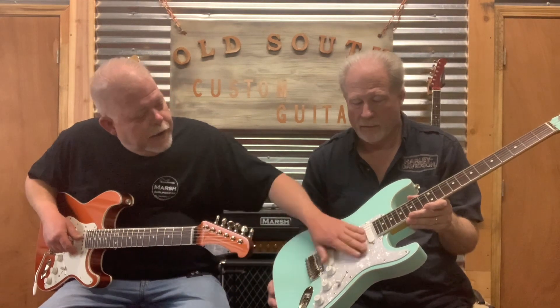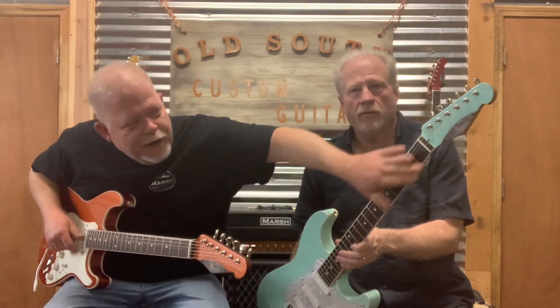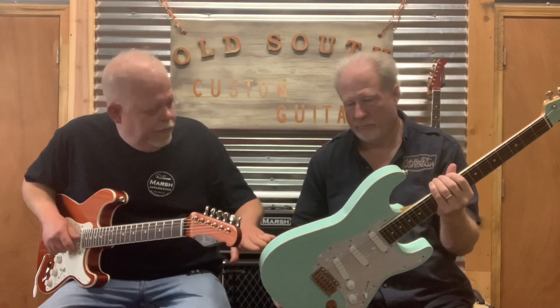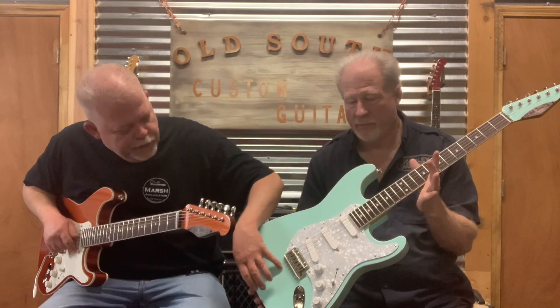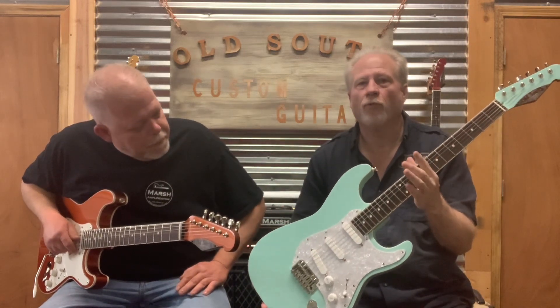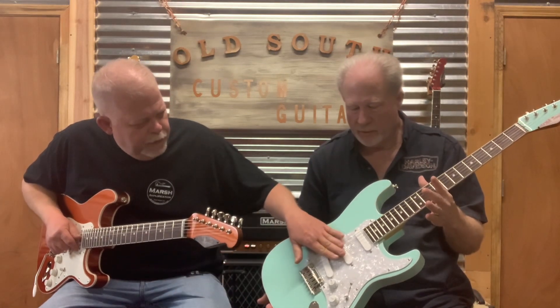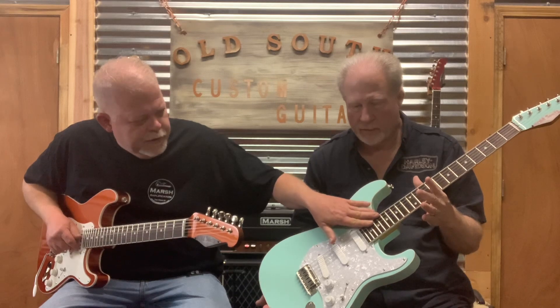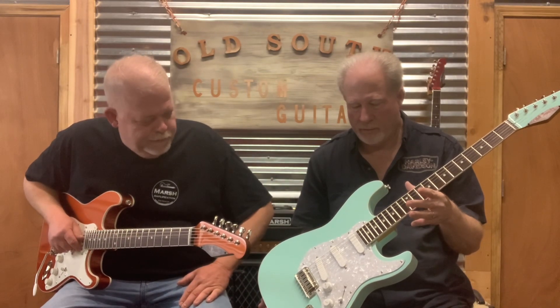We have our logo on everything, based off vintage signage — kind of a rusty look. Locking Kluson tuners. These bound bodies are basically hollow in the upper and lower bout and solid down the center, so the weight relief is really nice. The weight is very comfortable and super balanced when it's sitting on your lap. All these guitars in this run have a compound radius — I did them 12 to 16 — and there's no fretting out; it just plays fantastic.